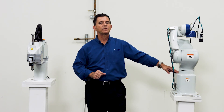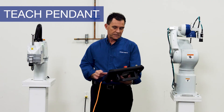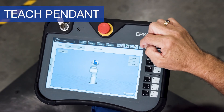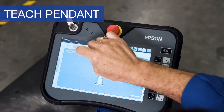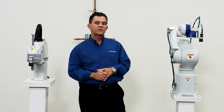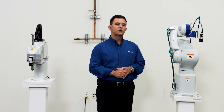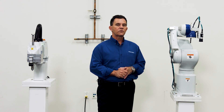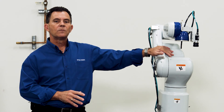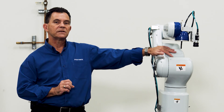Some of the features of this robot include an optional teach pendant available on both the VT6L and the T-Series robots. Teach pendants give you full interface control — you can jog the robot, teach points, access programs, and start and stop the robot. One of the key market applications for the VT6L is the injection molding and machine tending environment, which immediately leads to larger moment, larger tooling, and better load control as a requirement. You can imagine this robot going into a mold machine with a large tool pulling out parts with a large surface area. The moment capability for the VT6L is impressive for the payload.